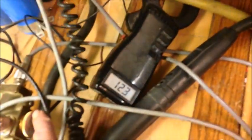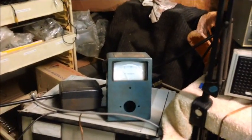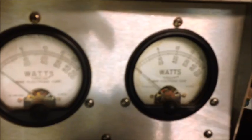Now, we're under test scenarios right now. And basically a little 2 pill going into the 24. I got a 5 watt slug. Got my amp meter right here. Initial dead key 450. I'm dead keying about 1100. Reflect on a 5 watt slug under a watt, and here it is under modulation. Oh yeah, just stays there.